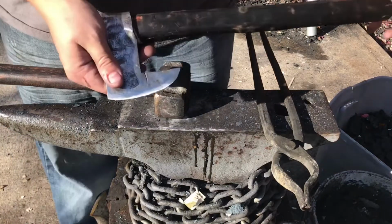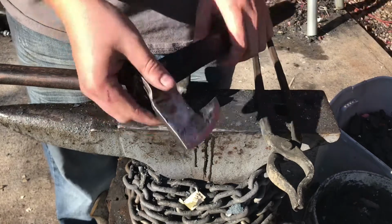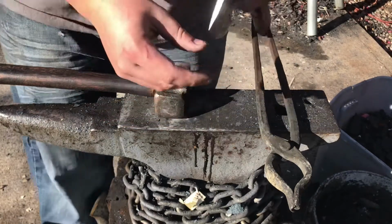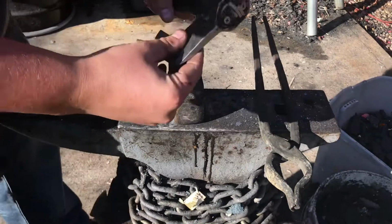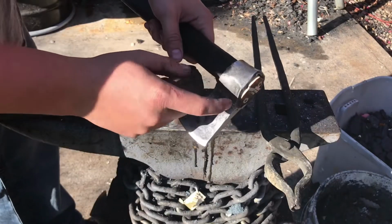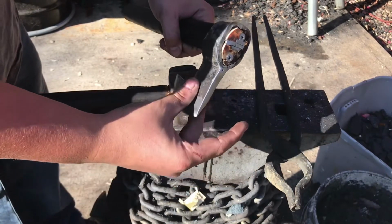Back to my channel. So today I'm going to be showing you guys how to make a folded hatchet. Now, what a folded hatchet is, instead of it being one solid block like my hammer here, where you punch a hole through the piece of steel, it's actually one long flat piece bent around something roundish like this, and then forge welded together up here.